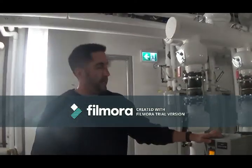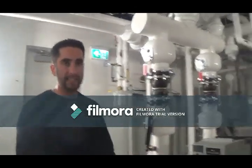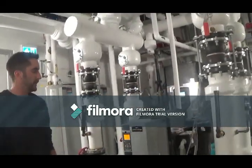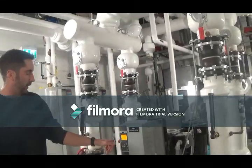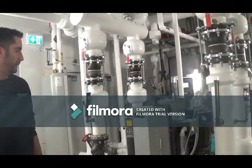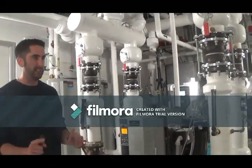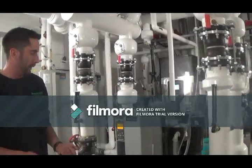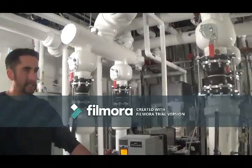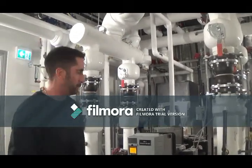Okay, so here you have heating water pumps 1 and 2. These are lead, lag, standby rotation. You've been rotating them every Friday, just putting one in hand, one on and one off. We monitor these, so if we see them fail or we see one not on at all times, we'll call you and give you a shout. We'll get a page. We also see any alarms that come up on these as well. So if we see an alarm, we'll blast and come reset them.